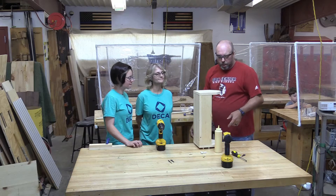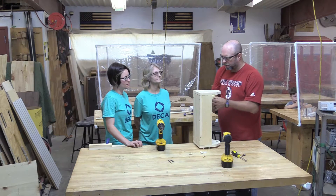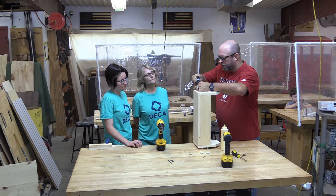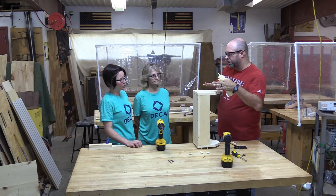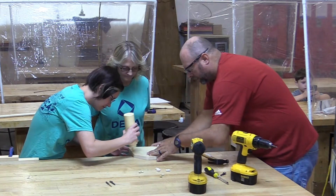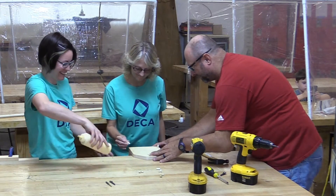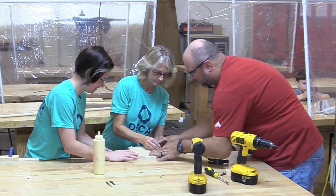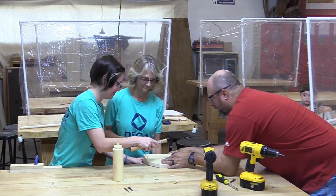The advantage of the button is it hides any imperfections. To install a plug, put a little drop of glue on top of the screw — enough that it's going to bite — then use a rubber mallet or small hammer to tap them in. You can get them to go in by hand and just give a little tap. Use traditional wood glue as long as everything is unfinished. Go ahead and do them all — you have five minutes once the glue is in.